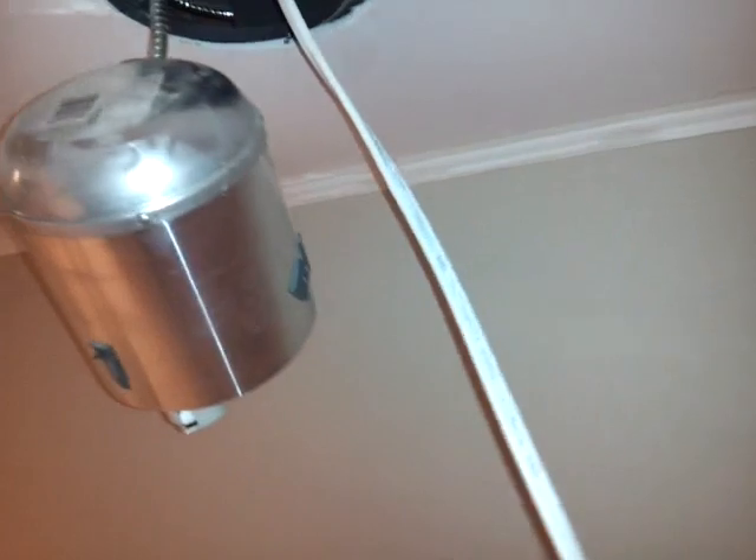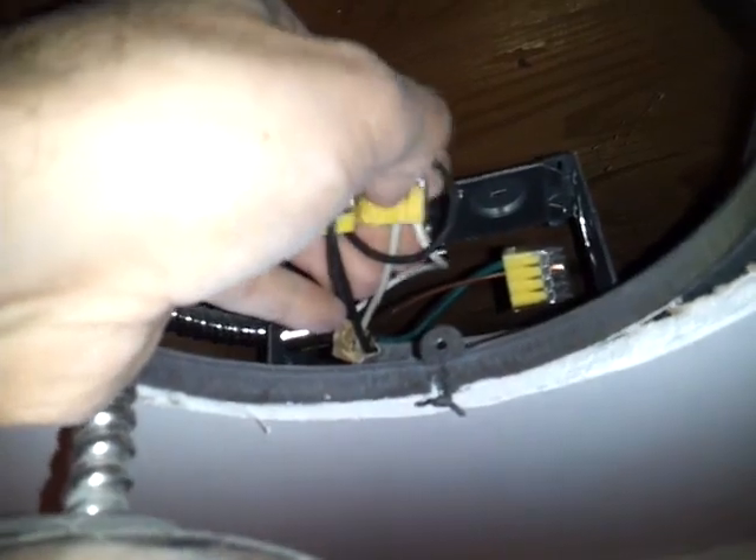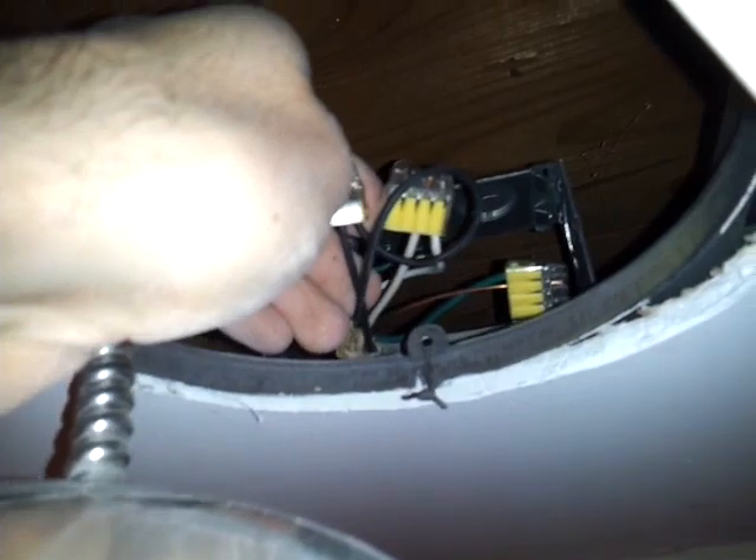Now I'm just going to connect this to this hi-hat. I'm going to cut this wire like I did up there and connect white to white, black to black, just like I did before. There's a junction box for this right over here, so I just have to pop it open and take that off. This was already connected — just like I did upstairs. I'm going to strip it: the white goes here, the green goes here as ground, the black, the white, and the ground is the green. That's how you connect it in series.